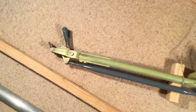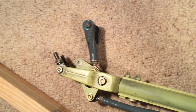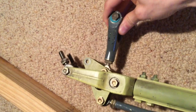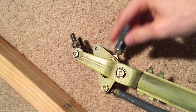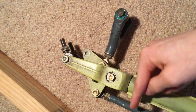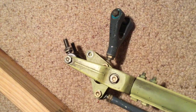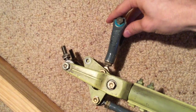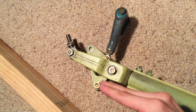With the way the controls mix into the rotors there are actually two issues that need to be solved to make it work in a simulator. The first is that because this is bolted to the collective, when the collective goes up and down it moves the whole assembly which changes the roll. The second is that there's a difference here — the bell crank geometry means that when the pitch control moves it rotates around one point instead of another, meaning when the pitch comes forward this part stays the same because it's bolted to a physical thing, and this will drop — so when pitch moves, the roll control is affected.